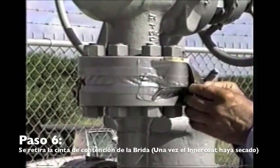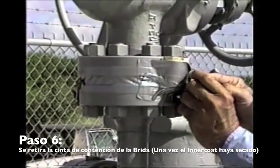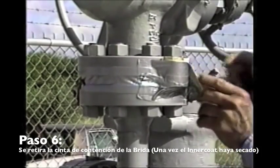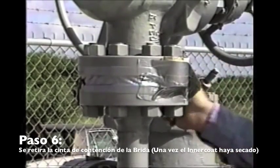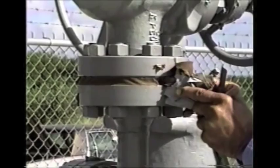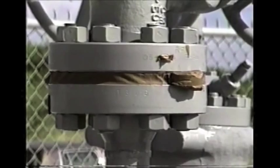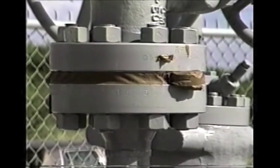We're going to use a sharp knife to start pulling the tape back. You may have to split it — take the knife and split the tape to land against the flange, then start pulling it back. Get a hold of it and pull it on around. It leaves a good finish, and your cup comes off with it. Save the little wax residue for a remelt — it doesn't hurt to remelt this wax and use it again.